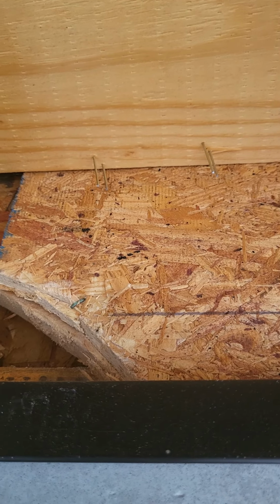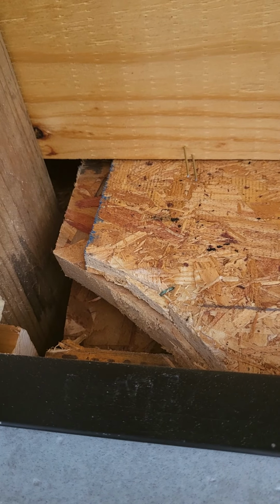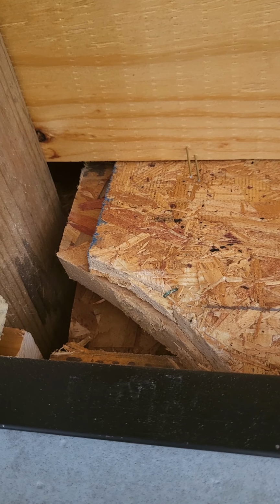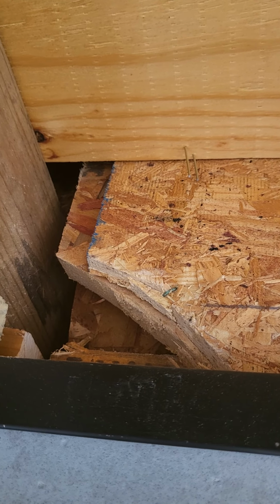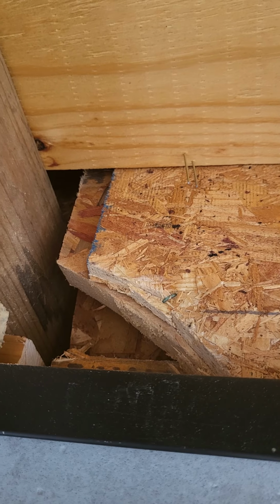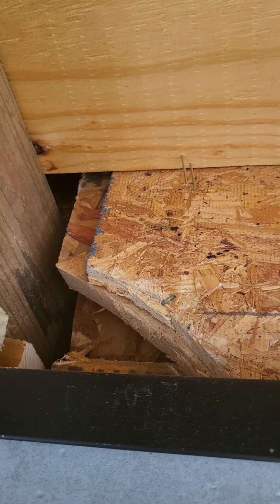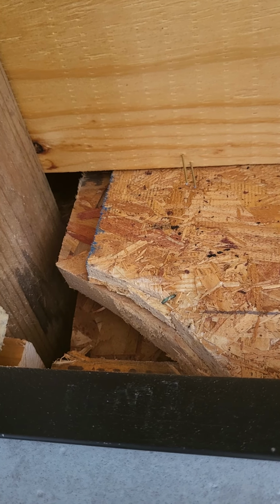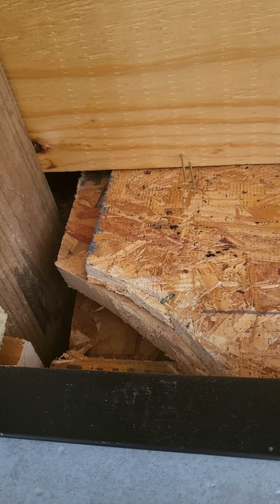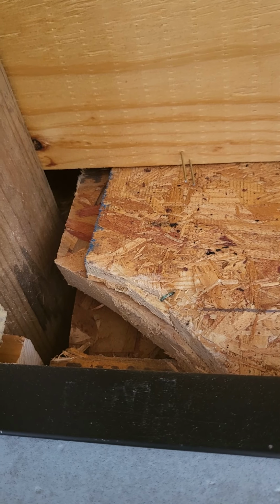I mean, I just finished making a video, or several videos. I was up there removing sheetrock for the engineer to check the welds. I said, oh, well, let me just check the bolts. At least 50% of the bolts bolting the steel to the column, to the knife plate of the uninspected, unengineered weld, they're not tightened. You can just take your fingers and back them off. So, it's just...